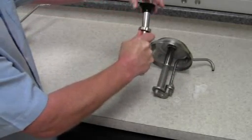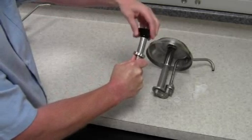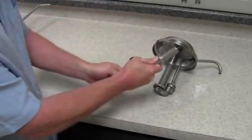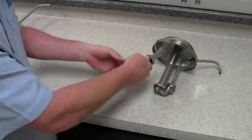With the other hand, unfasten the knob. After removing the knob, carefully allow the spring to fall back into place so as not to shoot parts across the room. Remove the head tube from the spring, and place a finger in the end of the head tube to keep the head insert from falling out.